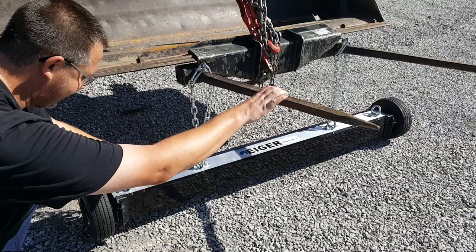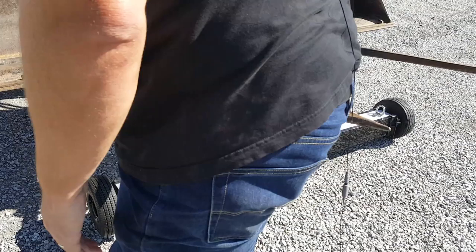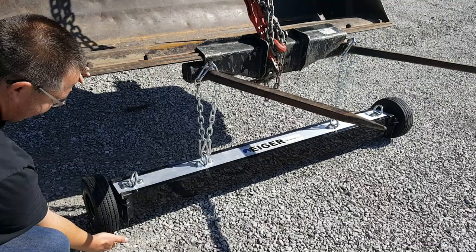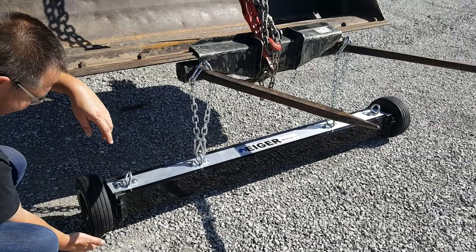The purpose of these bump wheels is so that when you're driving around and you've got a piece of equipment or a vehicle that's bouncing up and down — this backhoe is pretty heavy duty — when your vehicle is bouncing up and down, most magnets will hit the ground and it can cause you to damage your magnet or break the housing or wear it out over time. These wheels will contact the ground instead and it'll sort of act like a temporary trailer.